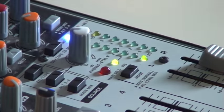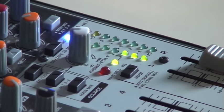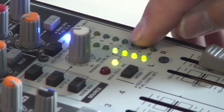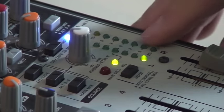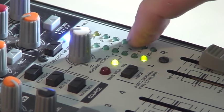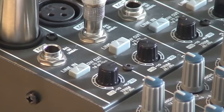So while checking, keep turning the microphone gain up and you'll hear it getting louder and louder. So now there's quite a bit of noise. I'm going over the 0 mark, so I've got to come back down. Check, 1, 2, 1, 2. So most of the time when I talk, it's up around the 0 mark. So that's what we want. So we need to remember that we can't turn it up any more than its current location.